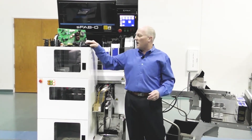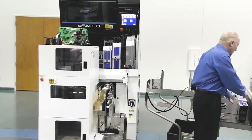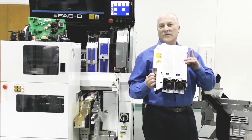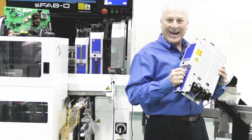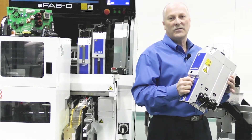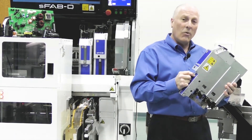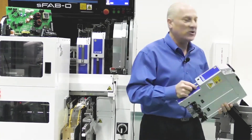This is a spinoff of our NXT and our head technologies have been maintained with our concept of constant uptime and offline maintenance requirements. The head technologies within the S-FAB have followed through from the NXT. We continue to offer dynamic, interchangeable, quick change placement heads with no tooling requirements. Operators and technicians can perform the same head exchange, re-adapting to changing odd form requirements, and most importantly, taking this maintenance practice offline to keep your production cells in production.